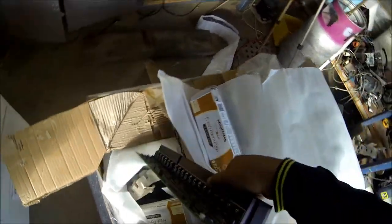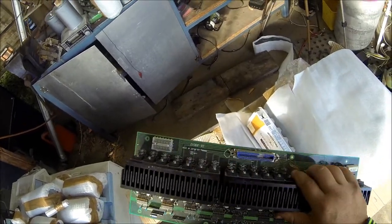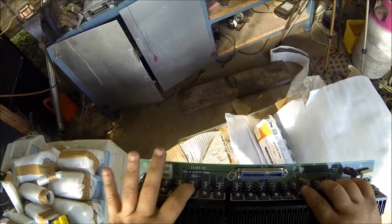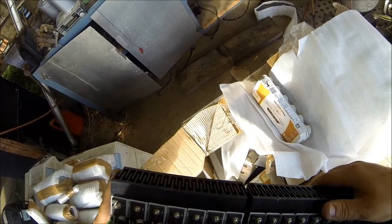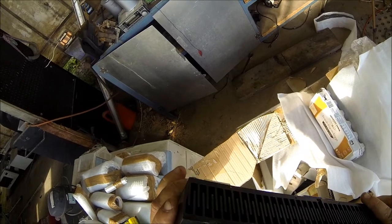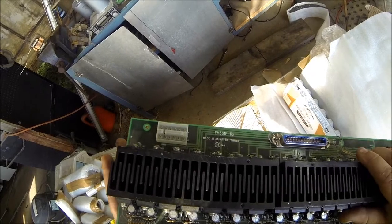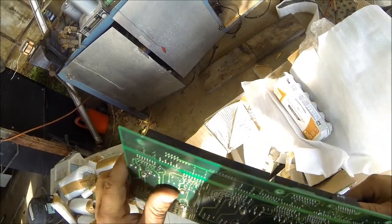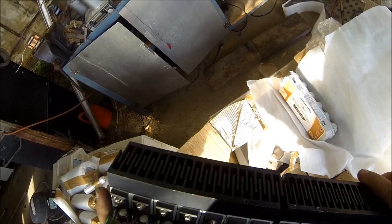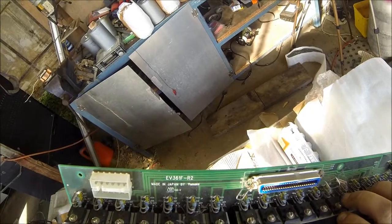That's almost enough caps to make an induction heater right there — an actual resonant tank style one. I was waiting for them to arrive. I'm going to cut that entire end off and use it hopefully as some kind of flyback driver. Even if it means I have to desolder them all one by one, I don't mind. There are snubbers on there — it looks like the electrolytics are being used as snubbers, though I could be wrong.